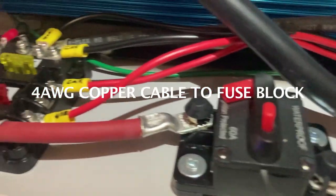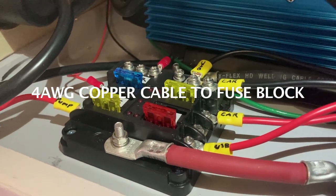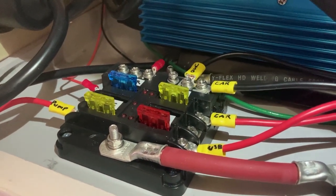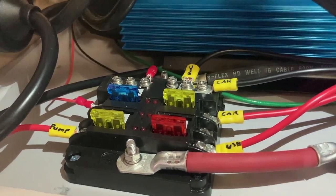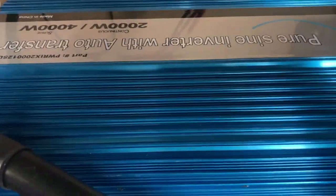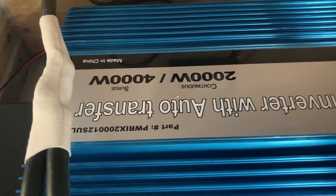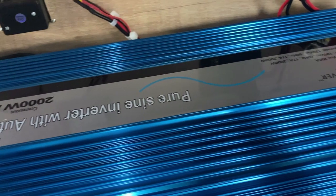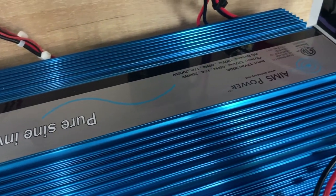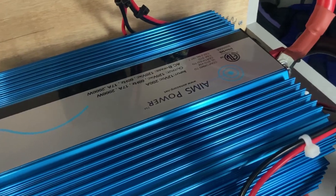The 2-0 cable comes into the inverter from the battery, and the leads from our amp meter effectively measure battery draw during a power outage. This is a 60-amp breaker connected to the positive battery lead with 4 AWG cable, sitting between the battery and fuse block to act as an on-off switch for DC devices as well as protecting all connected components from power surges. Here we have the fuse block itself. Connected to this block are separate fuses for the extra DC output, the two backup pump plugs, power for the two battery meters, and the two USB charge points. The inverter is rated for 2000 watts — far above what my system typically draws during a power outage. The surge rating of 4000 watts is for draw during startup, such as a compressor coming on. Pure sine wave is better than square or modified square since it is clean power that will not potentially harm your heaters, pumps, and reef controllers.